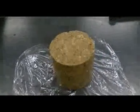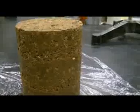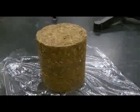Now let's put the membrane inside this water tank. We have to soak our membrane for at least 16 hours in distilled water before we start our test. Now let's look at our specimen — it is a remolded specimen from a standard proctor test. As you can see, it has some large gravels trapped inside the specimen and it's a very large size compared to our triaxial test specimen, so we have to trim it.